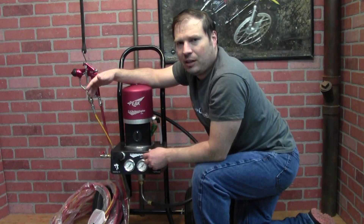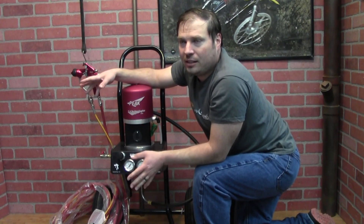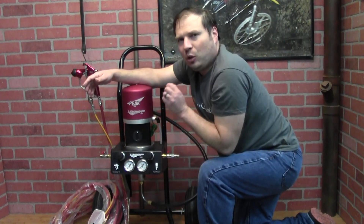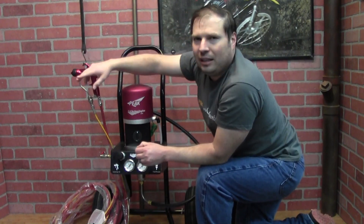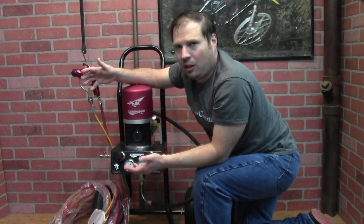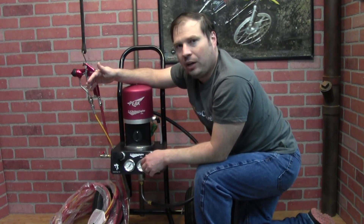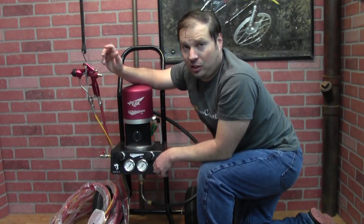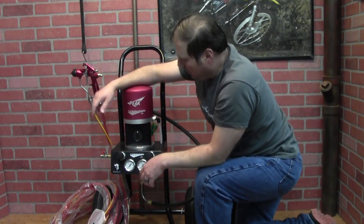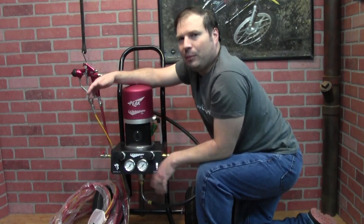Some specs: the maximum fluid pressure of this model is 1500 pounds, max inlet pressure 107 pounds. Unlike a conventional electric airless that uses fluid pressure alone for atomization, this does the same thing but at a much lower fluid pressure — so you're not spitting material at the surface and having it bounce off and go to the ground. You can typically run these at 20 to 40 percent lower fluid pressure and use atomizing air to get a really fine finish — a finish quality you can't get with some other technologies at the same transfer rate.